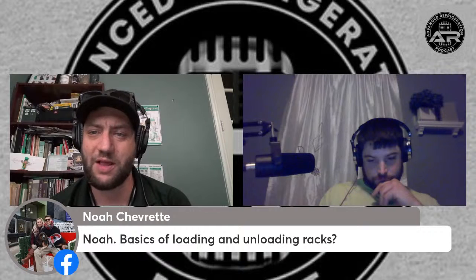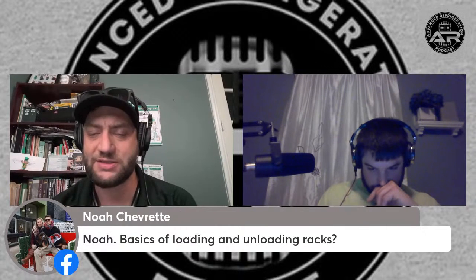We got this one. Know the basics of loading and unloading a rack. You're basically just trying to maintain whatever suction pressure you're trying to maintain for your saturated suction. Most unloaders are suction blocking, where basically it blocks off the suction to prevent it from getting any suction gas. That's why your suction pressure increases. I don't know if that's what you're looking for.